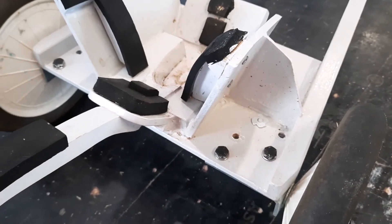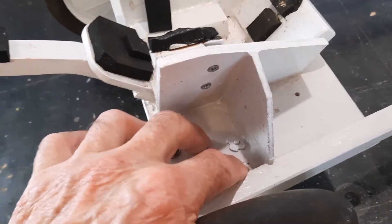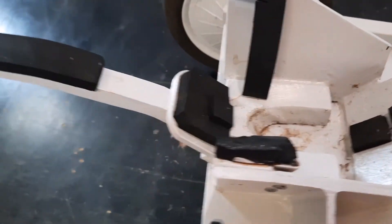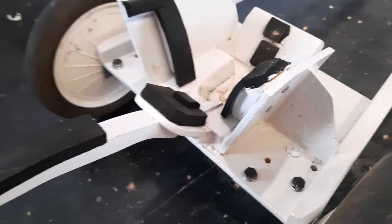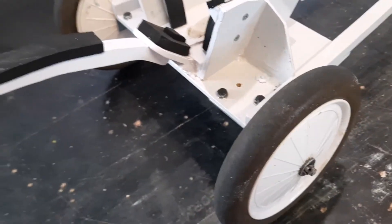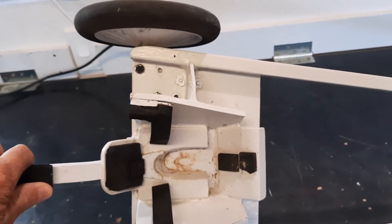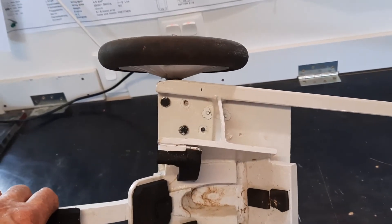The bolts — I've put two positions so I can move the axle mounting forward and back. I found the rear holes were just a little bit too close to the CG of the aircraft and weren't putting enough weight on the tail, so it tended to want to lift the rear of the dolly when you accelerate. I moved them forward and now it's just perfect. I'll tip it over a little so you can see roughly how far back it is from the actual axle position.